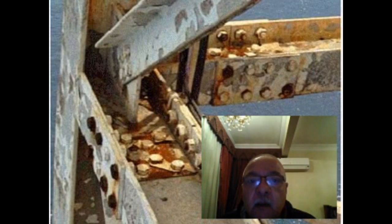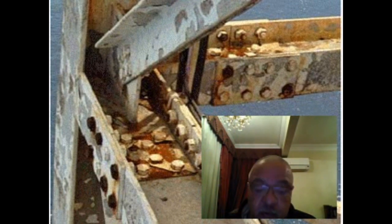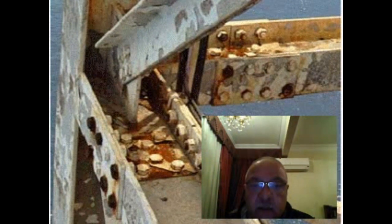This is the summary of the checklist which we must follow when we inspect the Derrick. Thank you very much. In this slide, damage to any of the main members of the Derrick could affect the actual load rating of the Derrick. In these slides, Derrick inspections would have revealed the extent of corrosion and it could have been cleaned and painted before it got too bad. In these slides, Derrick inspections would have revealed that some bolts were loose and they could have been tightened.